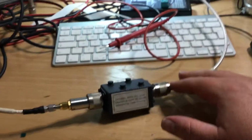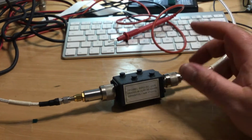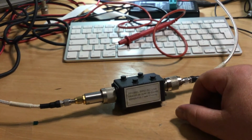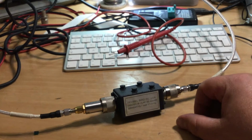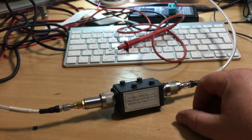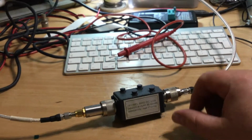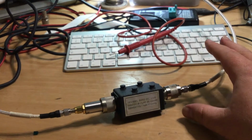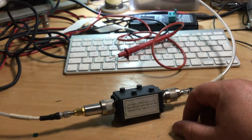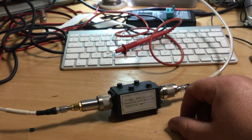A typical example of using that in an amateur radio setting would be where we're using, say, a ham portable radio into an external RF power amplifier that would obviously amplify the signal incredibly high. And also a mobile, perhaps a low power mobile that does 5-10 watts into a 300 watt linear amplifier, for example. In many non-commercial aspects, amplifiers that are designed for amateur radio tend not to have very good bandpass filter characteristics on the output of the amplifier.